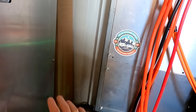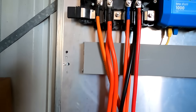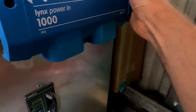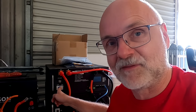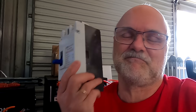Then I thought: why connect all this with a big breaker and Anderson connectors into these bus bars if you're using the bus bars anyway? Why not mount the bus bars somewhere over here, connect one side to our main bus bar system of the battery shelf, and then have the cables coming out down here to connect batteries as needed? Most batteries come with circuit breakers these days, so you could safely connect the battery and then flick the circuit breaker as the main switch. That would save me from having to install this big breaker.